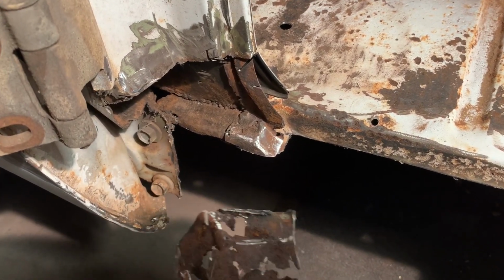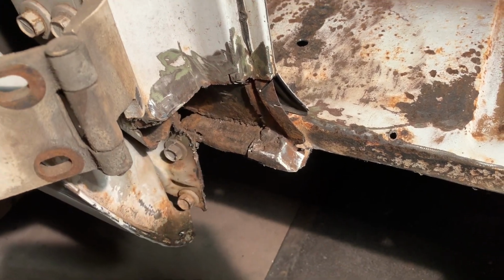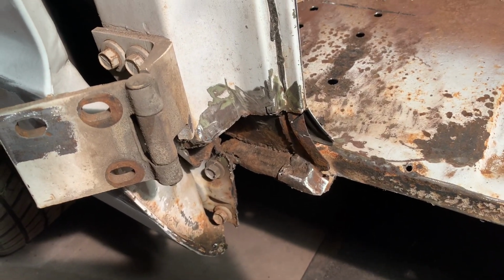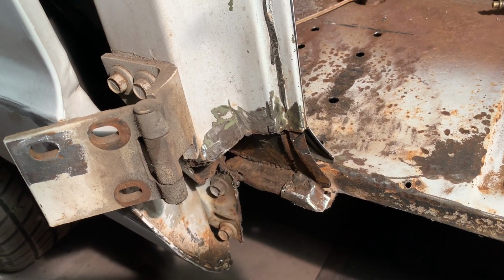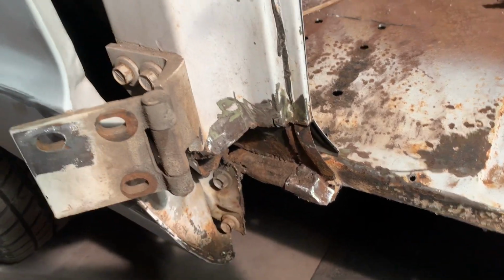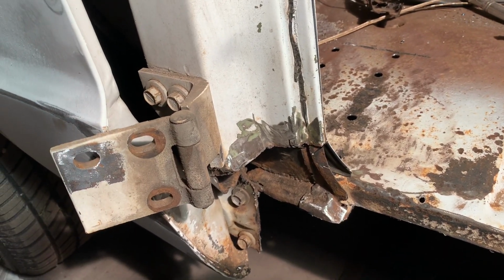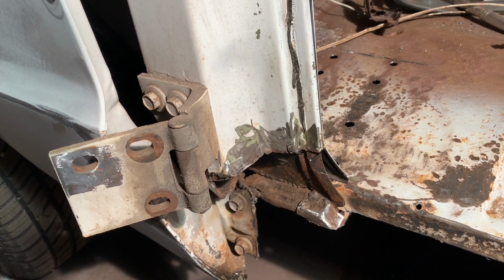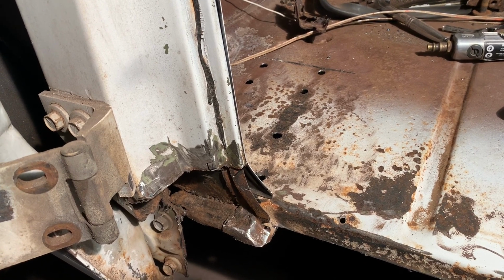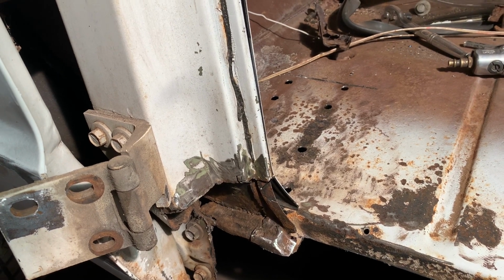And that'll go under the new rocker. And then I'm just gonna have to treat this, probably brush some POR15 up in there, because we're getting into the A-pillar there, and it's pitted and rusty, but it's fairly solid. If we go any further, then we're into the hinge. And if we go past that, then we're into pulling the whole front clip off. And like I said, you gotta decide where to stop. So we're going to do everything we can to treat that and weld some new structure on it